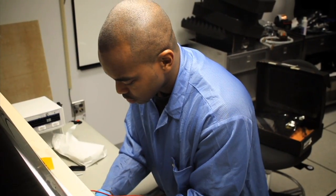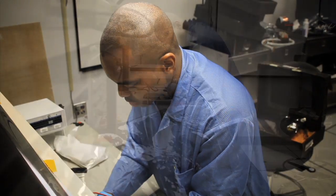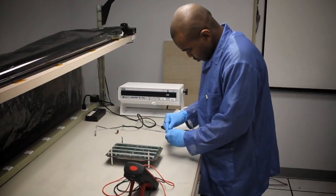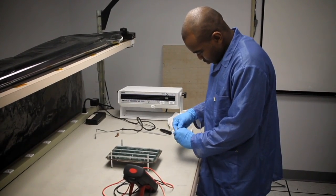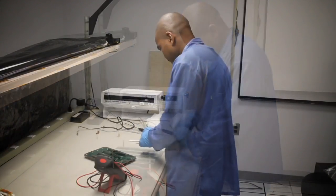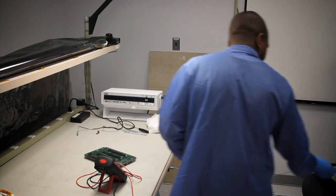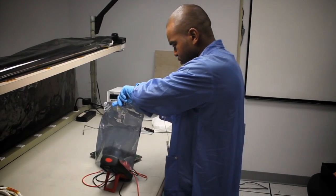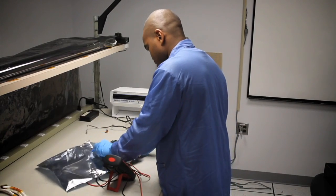I am a member of the CNDH, which stands for Command and Data Handling, subsystem. I'm a member of their design team, and my particular role on MMS was to design a back plane, which essentially is a bridge that connects the multiple cards within the CNDH subsystem together. It was pretty challenging, and it was definitely a great work assignment.